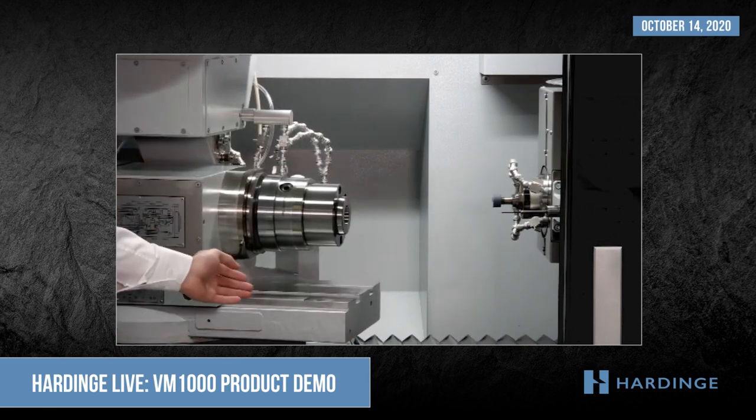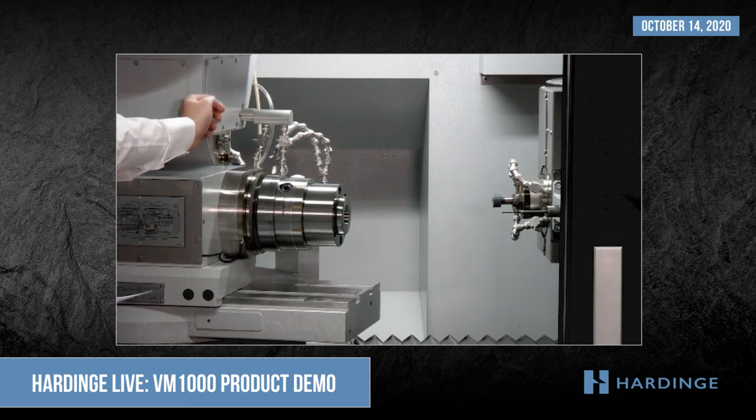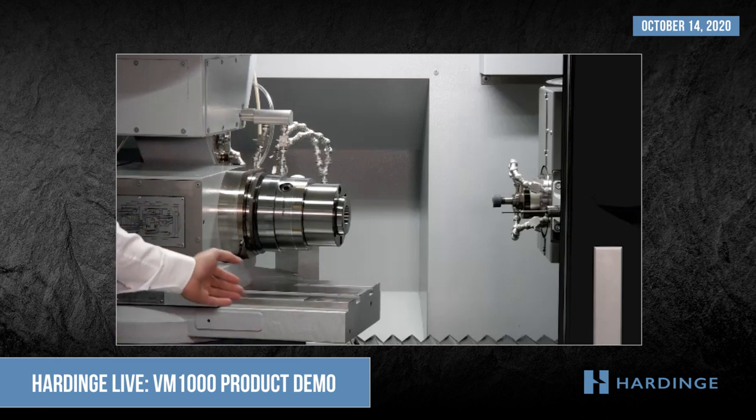To the workpiece carrier of the VOUMARD 1000. It is defined as a combination of the table, the workhead, and the dressing positions behind. This combination allows us to grind workpieces with a diameter of max 300 millimeters and a maximum length of also 300 millimeters. Let's have a glimpse into the VOUMARD 1000.